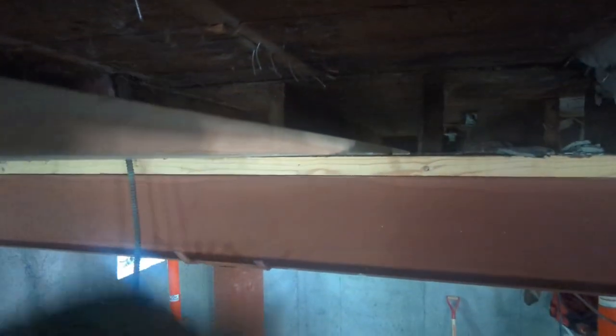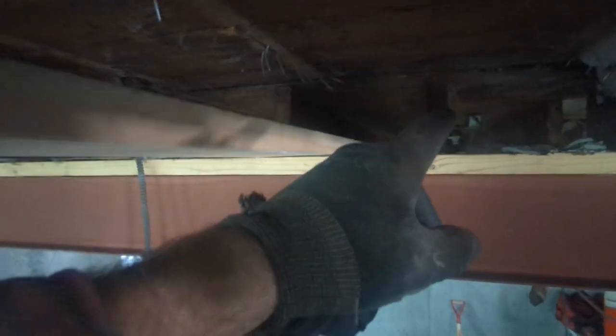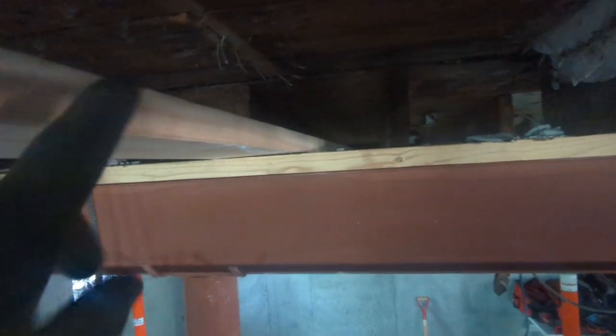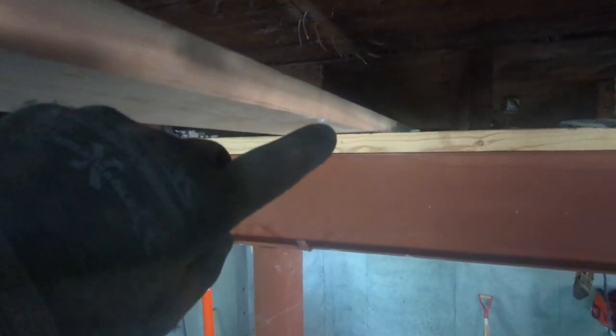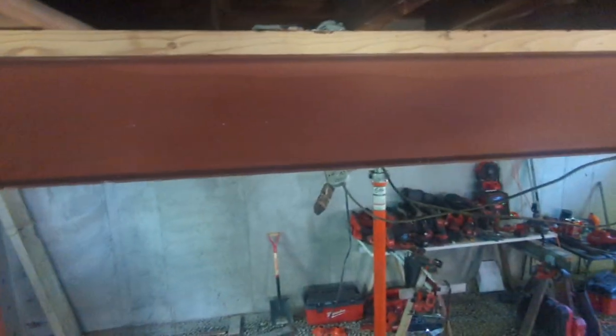The subfloor will remain attached to that all the way to this point, and we'll just need some more attachment onto this, another foot or two, a couple feet here, which is better than taking all the attachment away, replacing the joist and this one and the next one, and having essentially one of the highest traffic areas of the house in front of the refrigerator between the stove and the fridge and the sink, all without any attachment. It would just be really creaky. Could I put a bead of subfloor glue on this? And when I smush it in, would that be in there kind of? Yeah, you could get real tricky here, but that's not the nature of this project. We're going to get things done in a way that they could be supplemented in the future.